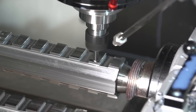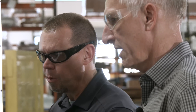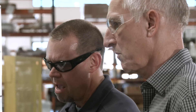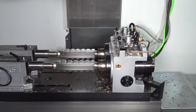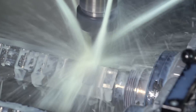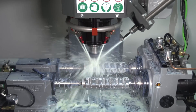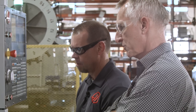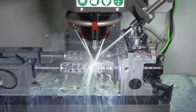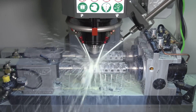I love the rapid. Now that you've got the stretch version of the DT-2 and the DM-2, it's almost the size of a VF-2 inside — less Z-travel, but almost the same X and Y. What's nice about this machine is its compact footprint, and if you compare it directly to a VF-2, you can take the same program and make the part almost 33% faster. If you've got a part with a bunch of holes, this machine is going to be incredibly quick — that's why we started calling it a drill and tap. All those rapids really take a lot of time out, and on this machine you can tap at 5,000 RPM. That makes a big difference when you're tapping a bunch of holes. And it's done.